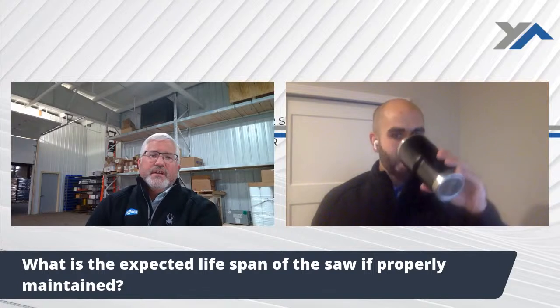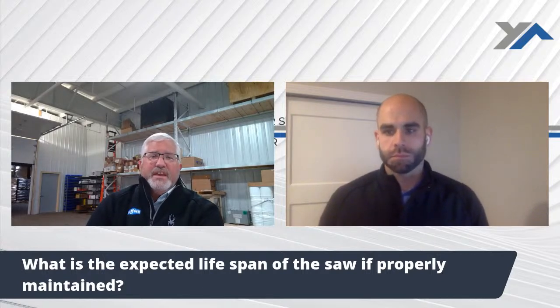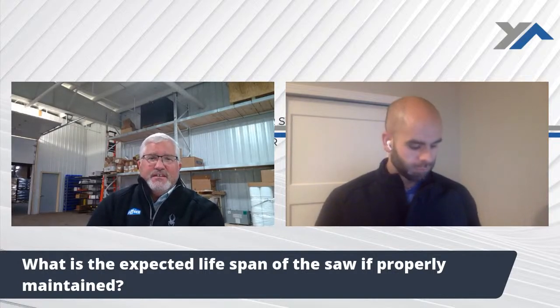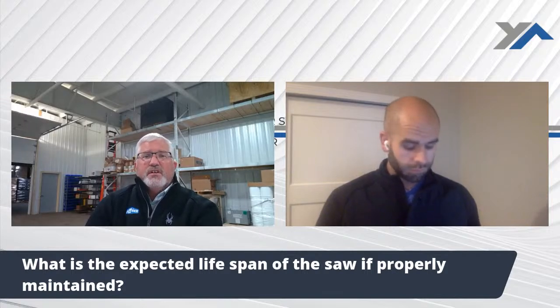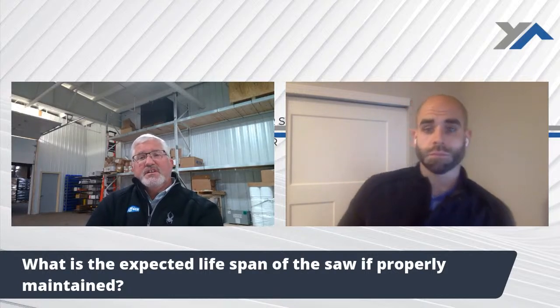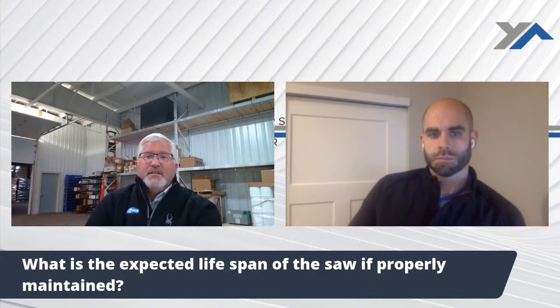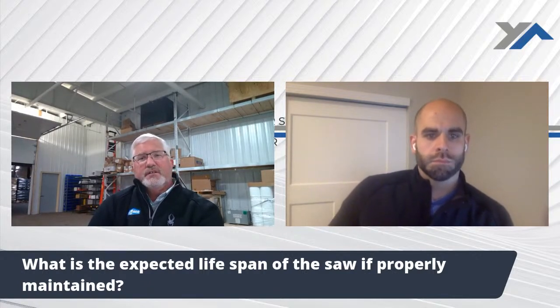Sure. So during the installation and training process, when we install the machine, our service techs will go over the maintenance side of it. What needs to be cleaned, what needs to be greased, etc. And if that is maintained, right, and done on a regular basis, let's say after every shift or every other shift, where you're cleaning out the chips out of the tub, so they're not being dragged back through the workpiece. Things like this, 10, 15, 20 years is more than achievable. So you may have to replace some valves or some belts or things of this nature, or some clamp pads that accidentally get cut off or whatever. But the reality of it is with a good preventative maintenance program, you should be able to get 10, 15, 20 years out of it.